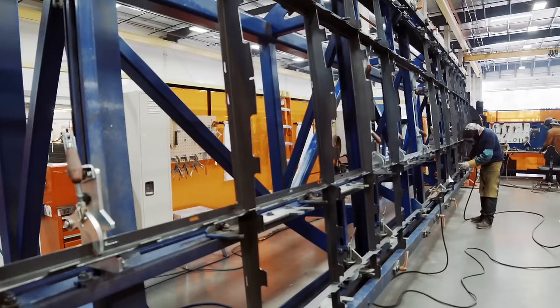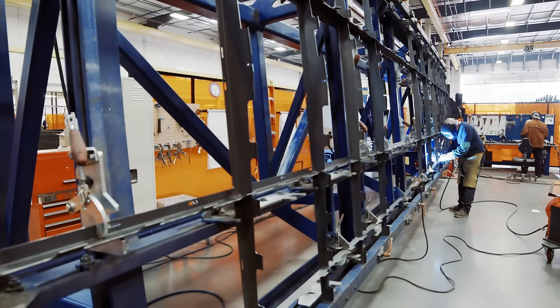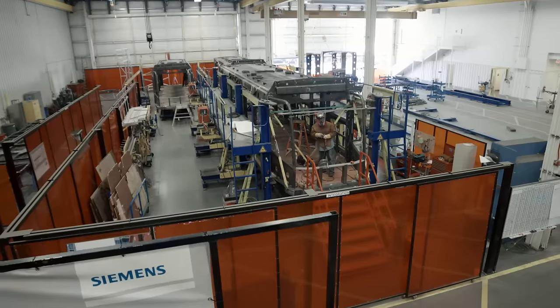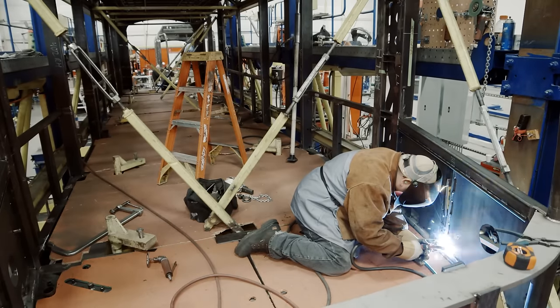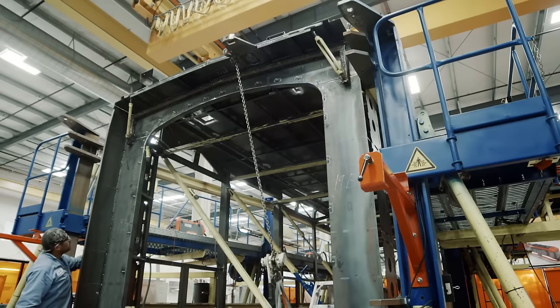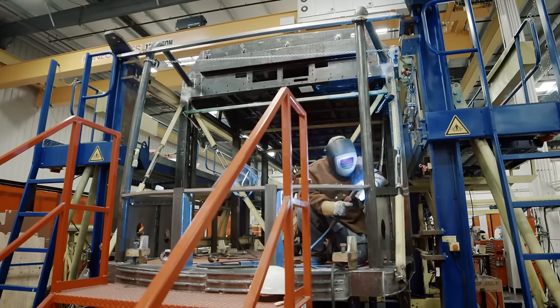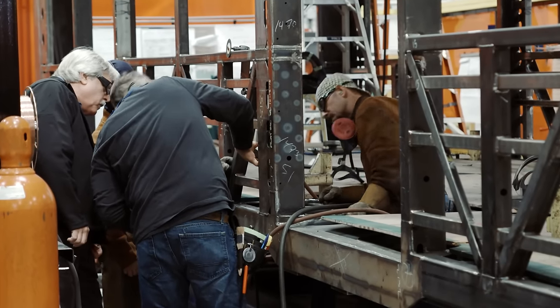In parallel to that, we have a roof station that's going on where we put in the ribs and then the roof skin. When all those piece parts are now ready to integrate, we put them into our integration fixture. The integration fixture is where we put the underframe in with the sidewalls, in with the roof. We make sure everything's within dimension, we weld it all together, and then put it into our quality check where we verify all the dimensions are correct and all the welds are compliant.